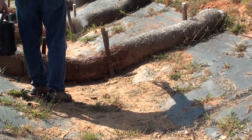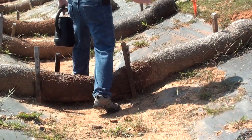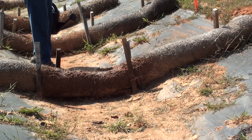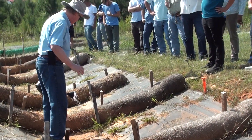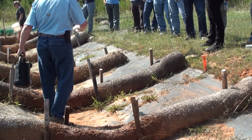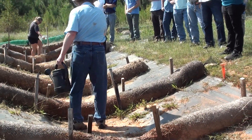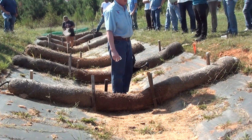The rain is going to pick up this powder. Now, what am I not doing that you're supposed to do? Two inches. That's right. Half of it should be on the uphill and downhill side and half on the wattle. And because we have a lot of sediment here, I'm not putting so much out on the uphill and downhill side. But if you have the fabric underneath your wattle, then you should be.